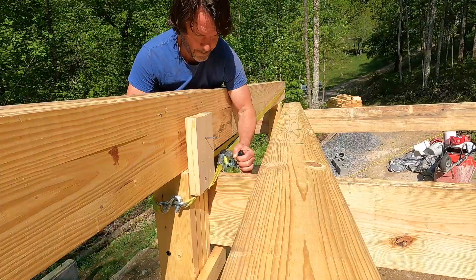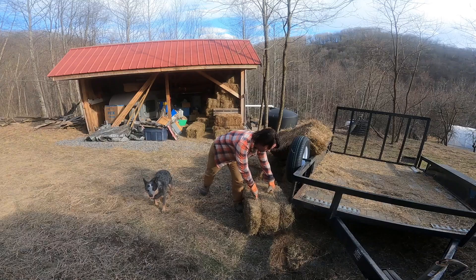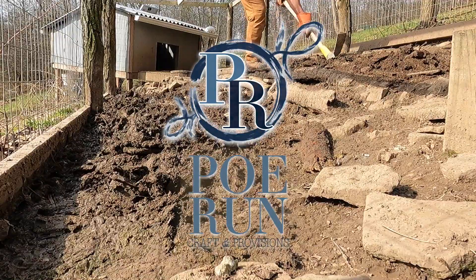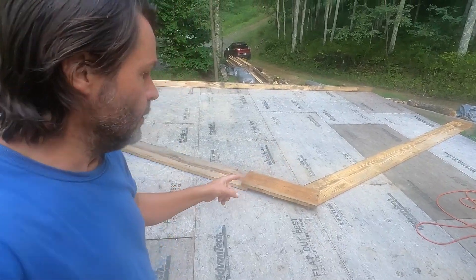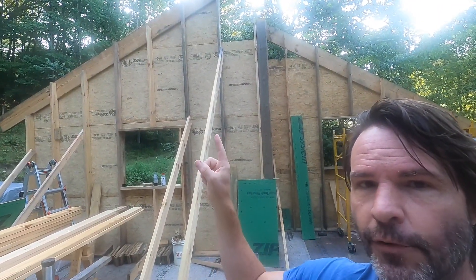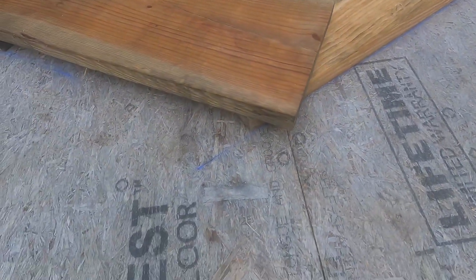The only difference here between the two is that I'm going to build it in two sections, but I'm going to be building the thing in one giant piece even though it's going to be in two sections for the lift. You can see I've chalked my lines for my angles. I did measurements off the top of the existing wall both at the peaks of the two walls as well as at the ends and a couple of spots in the middle, and transferred that into the angle that I chalked on the ground here.